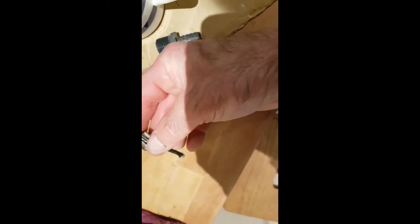I've took this off here — this is the outlet, the waste. And there's a valve, sort of like an injector thing in there. That looks really gammed up so I need to give that a really good clean. And the seal looks like it's a bit gone there — that screws in, that's the waste pipe. I'm going to give that a good clean up and see if I've got a seal somewhere.